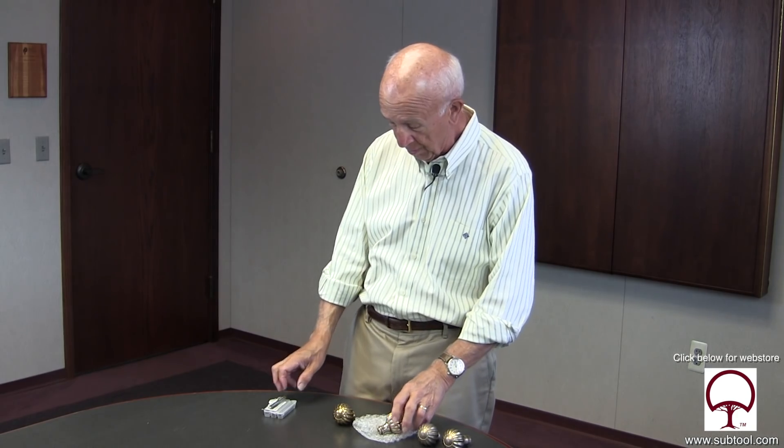That's how we solved the problem of grabbing it. The real issue we had was tapping the hole, which was an absolute challenge. What I didn't know — and everybody said bronze is very difficult to tap — what I didn't know was that that tap, although it felt sharp... what a lesson there guys. That tap felt perfectly sharp to me. It wasn't. And that's why it was so difficult to get the tap in and to get it out. You saw how I struggled with it — that was a son of a gun. So I got some new taps.